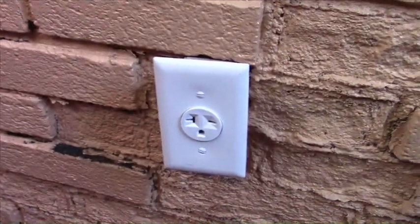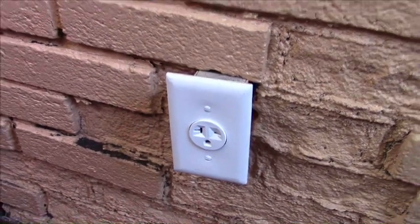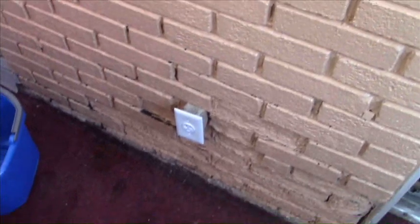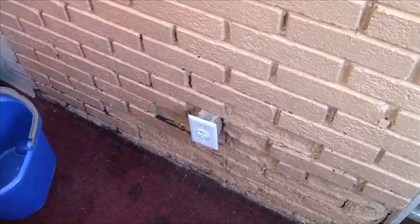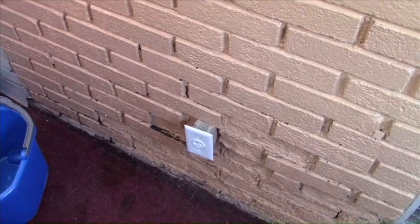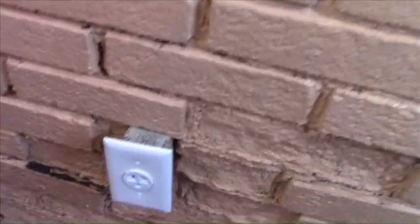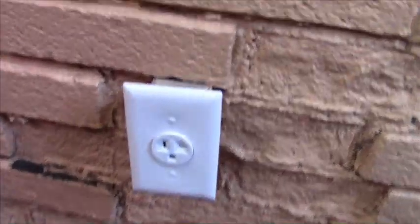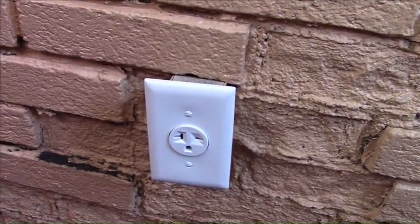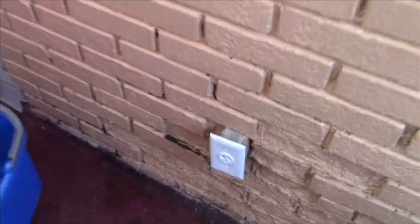This is my 6-20 outlet I put in the outer room in my house. Before I had my driveway, I had to park alongside the house to charge the car, and it was either use a 15 foot extension cord to charge off of my oven outlet's 14-50, which was impractical, or do this. So I've actually put in a 6-20 outlet here, and I'll show you what I have downstairs for the wiring to do it right.